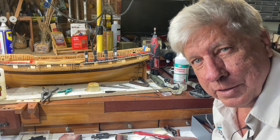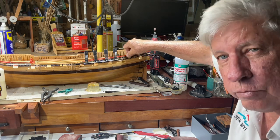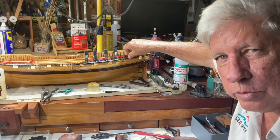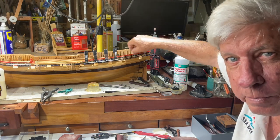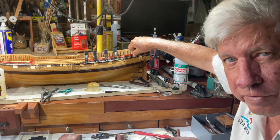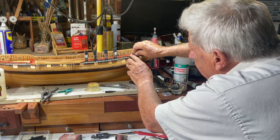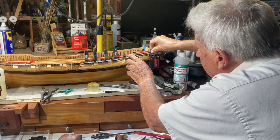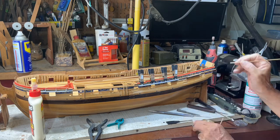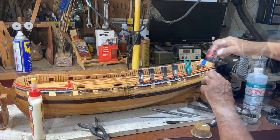Well, keeping it honest is my motto. So the molding on top here — I had fooled around with it when I was trying to figure out how the standards were going to go. And of course I cut them going right through the molding, only to check again and find out afterwards that it goes below the molding. So I have taken this out, made up a new piece, and I'll stick that in place. I was actually very lucky that when I got the piece off, I didn't damage the red paint.